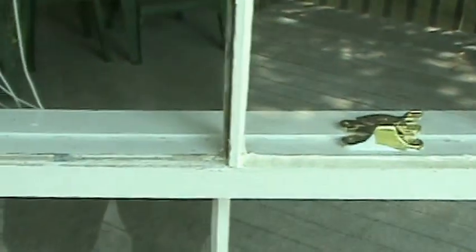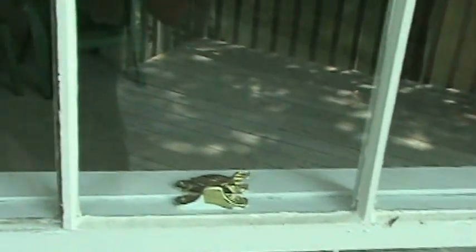I've got a nice 1/16th of an inch gap all the way around, so when it gets colder this winter here in Atlanta — or anywhere in the US — and this window frame contracts, it won't crack the glass. Now I'll come back in and putty and glaze it all the way around, let it dry out, and then come back and paint it to match.